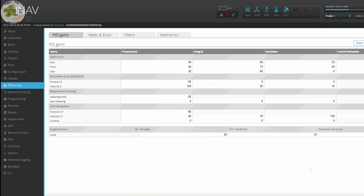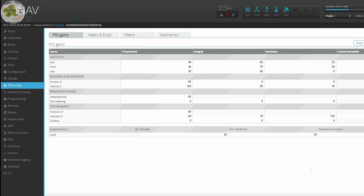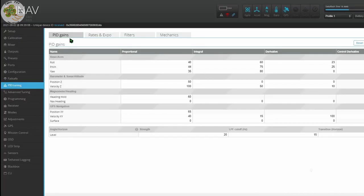They're all basically going to be the same, but a couple of the values I'm going to tweak just a little bit. Once we're done with the PID gains, the mechanics, the rates and expo for each of these profiles, then we'll go into the filters. The different profiles that you set up are described in the INav GitHub site, which I'll link below, and you can access using your stick commands. So let's begin with profile one, PID gains.